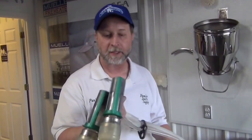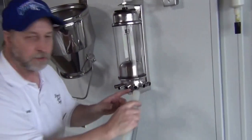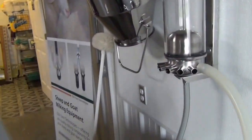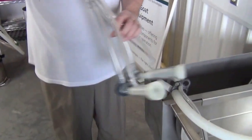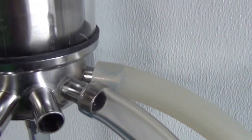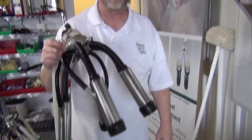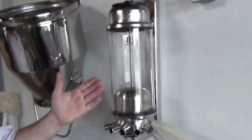The drain hose from the washer just hangs inside the little sink like that. Now we're going to attach some milking units. This is the Top Flow Z milk milking assembly, very popular today. We're going to attach the large 5/8 inch milk hose to one of the ports on the washer. Now we have a sheep milking assembly from InterPulse — this one has plastic hose which, if it's hard to get on, you can put it in hot water to soften a little bit. They don't have to go on very far because the vacuum is going to hold it on. Now we have a milking unit that comes on the 1501 Hamby Dairy Supply milker, so this is a cow milker. We're showing three different kinds to demonstrate that the washer will wash a cow, goat, or sheep milking assembly.